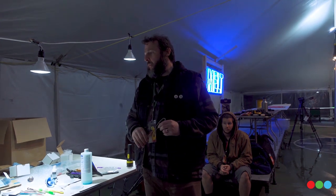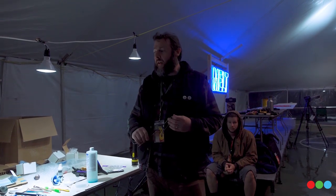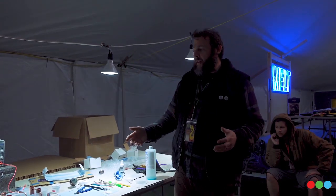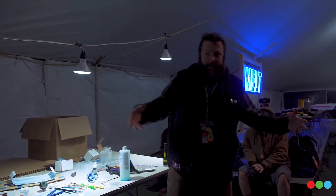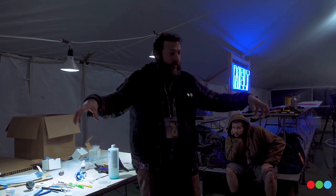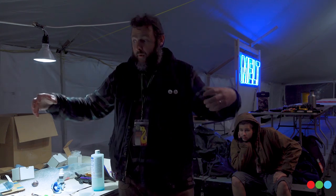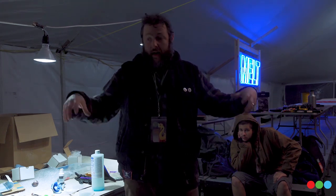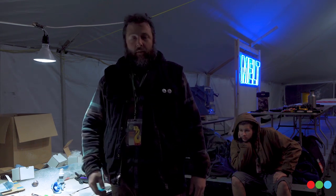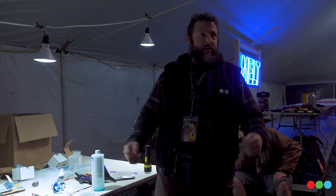That's brilliant, by the way, and I've not heard about titanium in rod form like that. Great. I will most likely go to that method. And what he's referring to is that if you went into a more industrial place where they do electroforming, you're going to find big baths with titanium anode baskets on the side with holes. They buy the anodes in big bags, little pellets, and fill those anode baskets on the sides. That's how they do it, because the titanium runs the current. So yeah, it's some titanium wire. It sounds brilliant, and it won't deteriorate, so you can just keep using them.